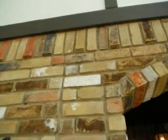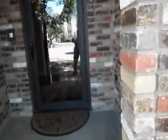At the front porch, we've got a settlement crack running down here. Yeah, it runs almost to the foundation. We have another settlement crack over the arch here. And we have more settlement here. You see inside here. Now this part of the building, yeah, it's almost like an extension of the building, so this could be just moving in this area here. And we've got more cracks there.